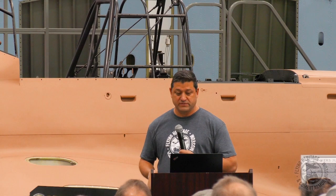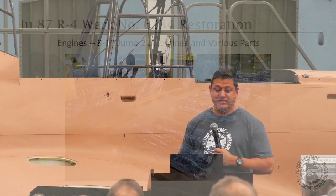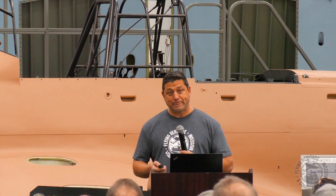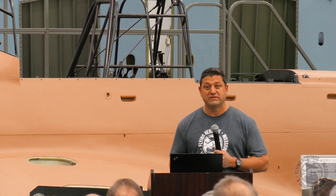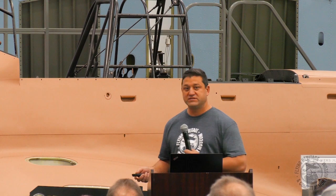You have to have engines. We collected engines all over the world — probably a total of 10 engines. We probably have 15 pallet loads of engine parts: fuel rails, hydraulic pumps, prop governors, lines, exhaust stacks — everything that goes with the engine. When you recover these engines, a lot of times they've been wrecked or schools have taken them apart or made cutaways, which is great for a school but causes us rebuilders to tremble and cry. But it might have some good pieces and might have the missing link, which is what you strive for.